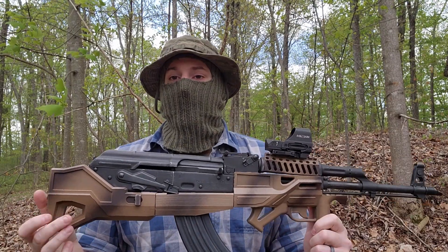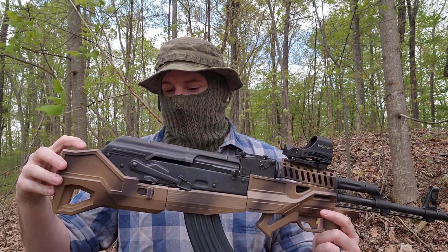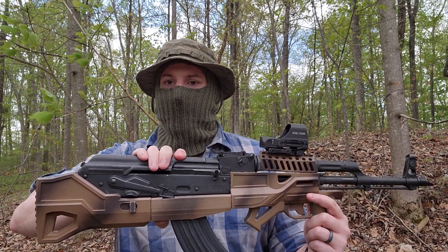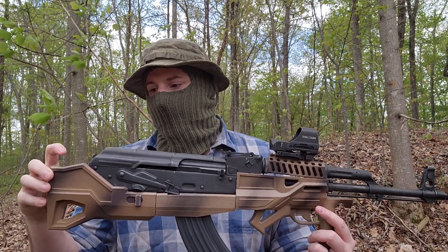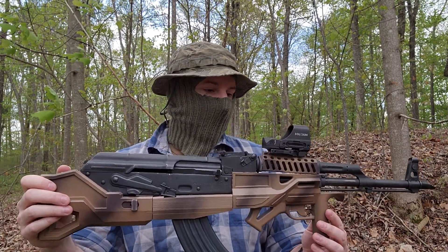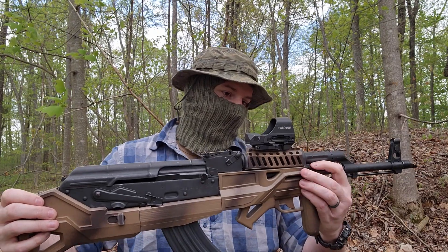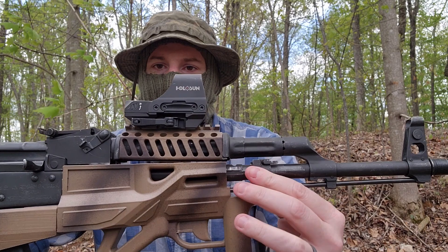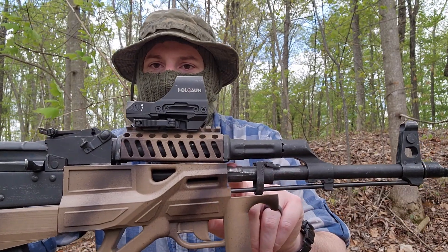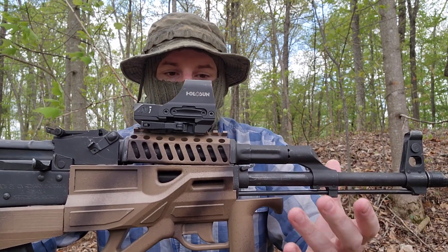Status on the Alpha — things that need to be changed and fixed, other than what was revealed by the test. I do know that I've got a couple of angles wrong here on the buttstock. When you tighten the screws all the way down, there's leverage opening right here, which also puts some pressure on those rods and increases a lot of that friction. So they're not fully tightened right now. I have already corrected those angles in CAD, but I haven't made a new model yet. I also have to deepen the groove here in the front where the retaining plate holds the front hand guard on — you probably saw in the video that this slid forward. The groove isn't deep enough so I'm not able to engage the catch, meaning it was just pressure-fit. So make that a little bit deeper.